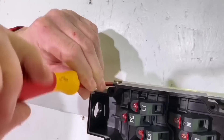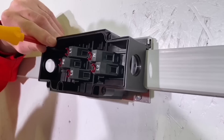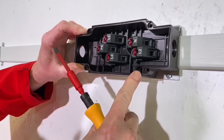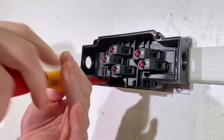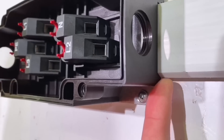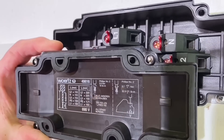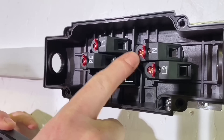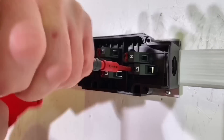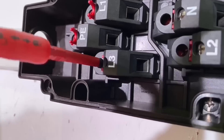The branching box has a polarity — you can see the angled edge on the right-hand side must be in the correct position. There are two fixing screws to secure it to the structure. First, fix the back plate to the wall, then concentrate on the other screws. Screw it down with the required torque setting. Then two Newton-metres of torque for the screws that clamp around the cable — this is just to fix the clamp and achieve the IP65 rating, sealed nicely against the cable. We're not penetrating the conductors yet at this stage.